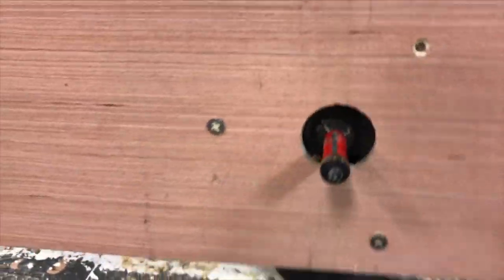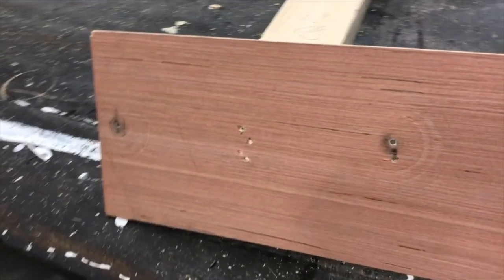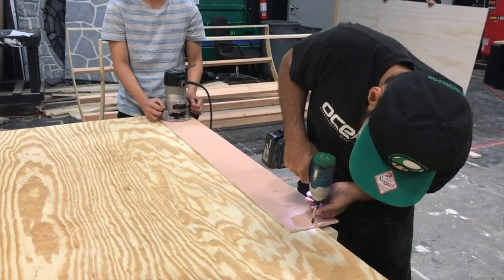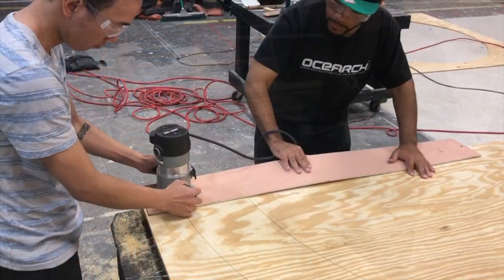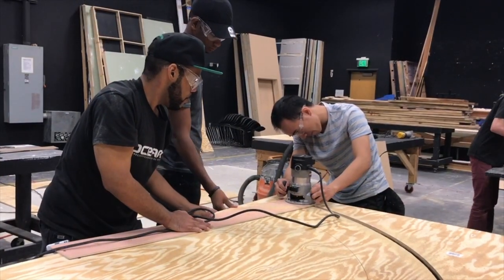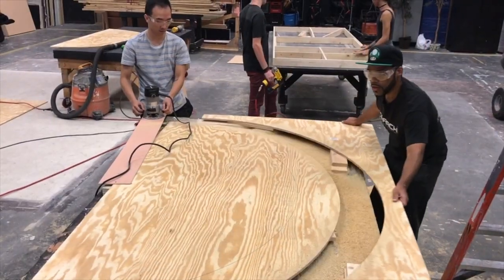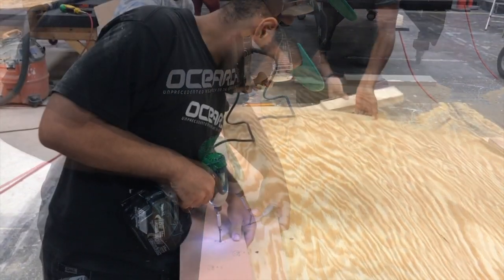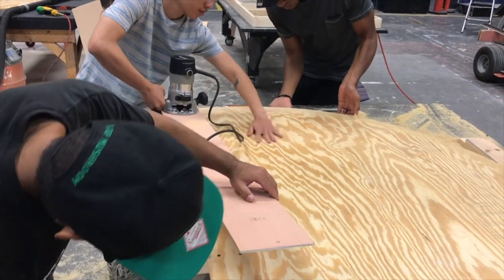This is the assembly we made for the router. We took a piece of quarter inch plywood, measured where our center point would be. We've got two holes marked there, took the plate off, marked our holes onto that piece of board — it's about six to eight inches wide. You can see it's already screwed down. If I remove the plate you can see it's just screwed right onto the router, and it is a flush trim router bit so it does have a bearing on it, but we're not really going to worry about that bearing riding along another piece of wood. We're going to trust that jig, and as we move the router around it's just going to swing around that fulcrum in the center and we'll get a perfect arc.